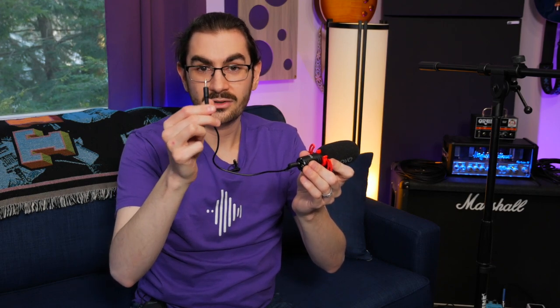You need to check. This VXR10 Pro is a TRRS. This is one of the cables it comes with, which goes into a standard TRS—in which case, TRS goes into what? An audio recorder or a camera. Make sure mic power is on, hit record, and three, two, one—now you're hearing the Movo VXR10 Pro via the TRRS-to-TRS cable, and it works just like that.